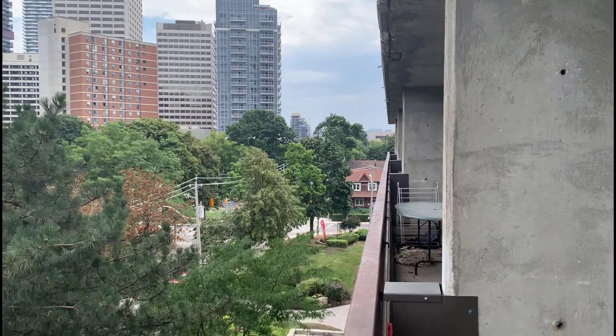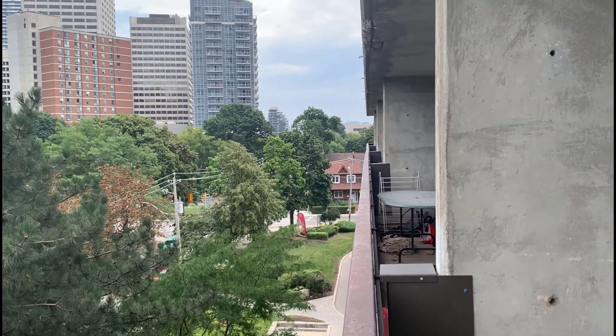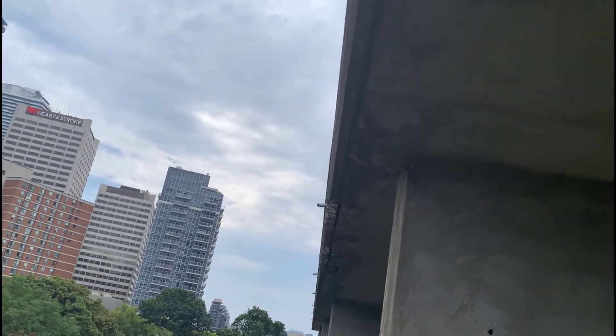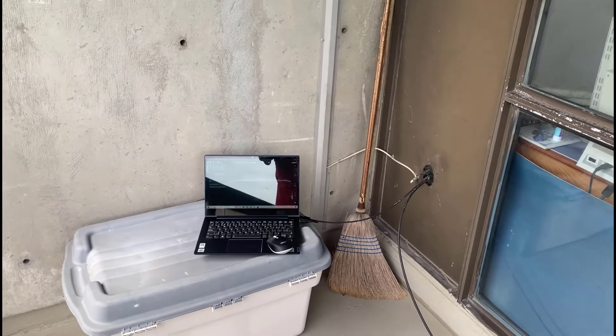That's my viewpoint and you can see the CN Tower in the middle — that's at 171 degrees. I'm going to be at 174 degrees, so that's three degrees to the right, then up 39 degrees elevation, and a tilt of four degrees. That's where the satellite is, and I'm going to switch over to Camtasia now so we'll see what we get on the computer screen.